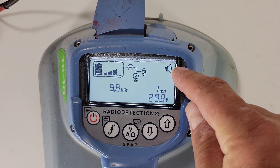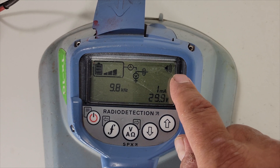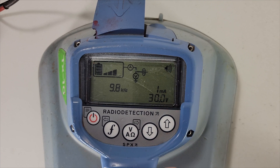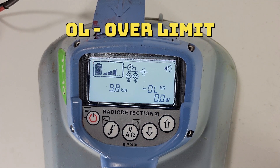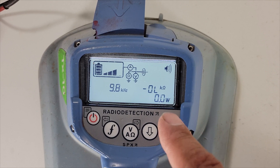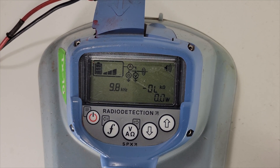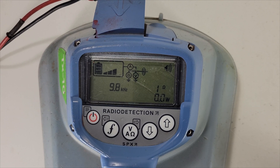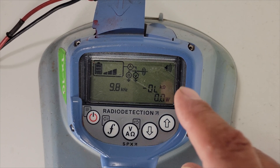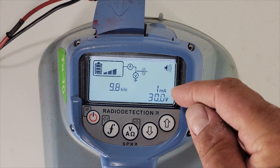Here is your volume display — you can see one, two, and three bars. It's telling me I'm set to max because the third line is showing, so I'm maxed out. Also make sure you're on amp and voltage mode, not ohms. As I mentioned in my previous video, if you're on ohms it will read the resistance on that line. Let me short the leads to show you — I'm getting one ohm. Make sure you're not in ohm mode. If you see that symbol, hit the V key to get back to milliamps and voltage.